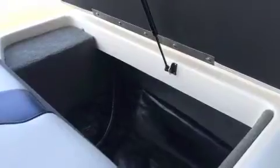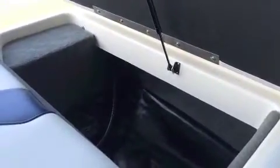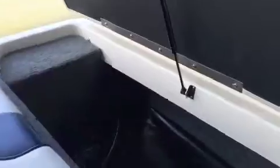Just so you can get a sense for what I'm talking about — when I say that the T-22 has soft tanks underneath the back storage areas on top of the floorboards, the Moomba has the same thing. So you're going to want to get in here and take anything out. That's the tank right there — it's just a vinyl bag that's got a hose going into it from the pump on the bottom of the boat. This is going to fill up inside this cavity here, so you're going to want to make sure that if you've got any life jackets or anything stored back here, you're going to want to pull them out.